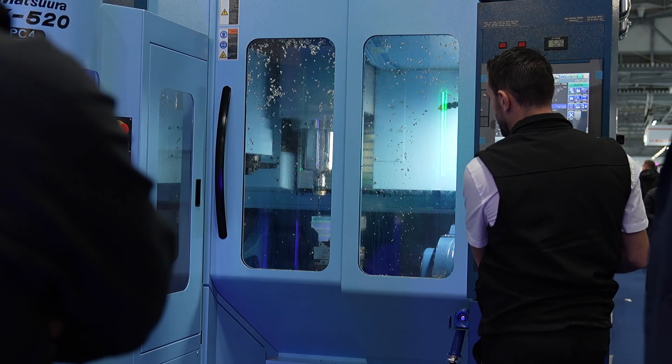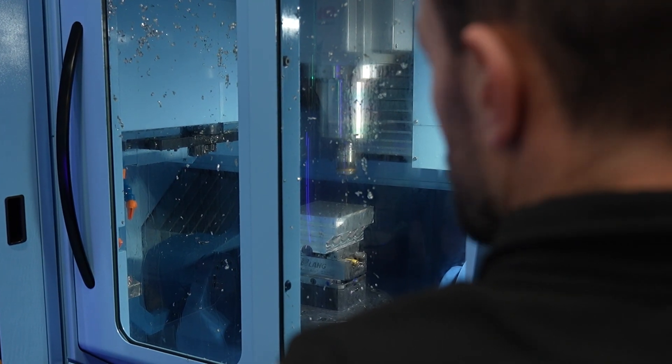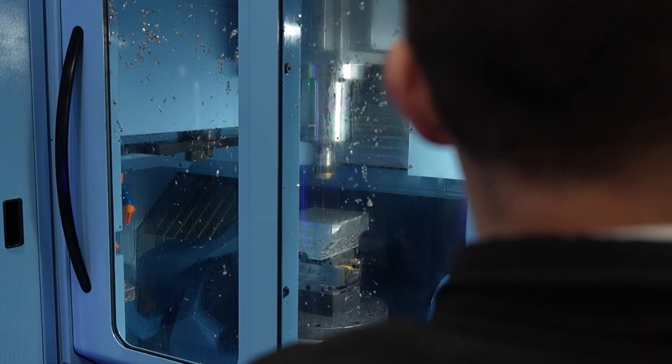There's also quite an interesting probing demo on show here. On this demo we have an operation one and an operation two, but we're only using one vice. I've incorporated Renishaw spindle probing to detect if your billet is bigger — that's op one — or if the billet is smaller, that's operation two. It automatically jumps into the program, finds the selected program, and it's all automated. So if you load the wrong billet, the program will find the correct program suited to that job.